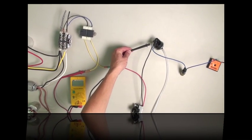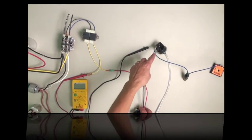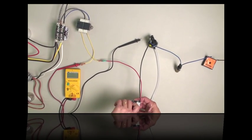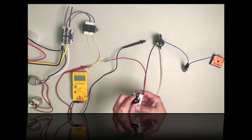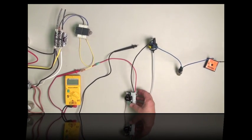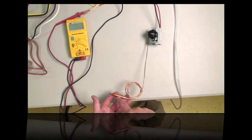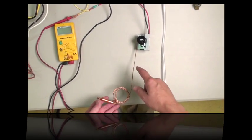If you don't have 24 volts from the thermostat, that means the thermostat isn't passing along the 24 volts, and that can be for a number of different reasons. The actual mechanical body may have failed — check to make sure that you can go all the way down and all the way up smoothly and that you hear the clicking noise. Also check the temperature bulb, which is down inside the heat exchanger on the water side. Make sure the bulb is seated inside and that the capillary line isn't kinked or pinched anywhere.